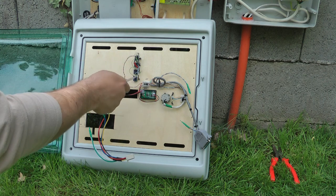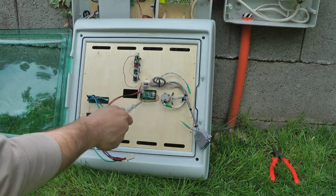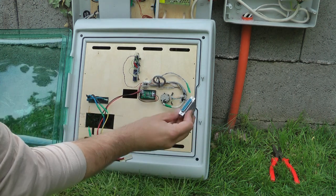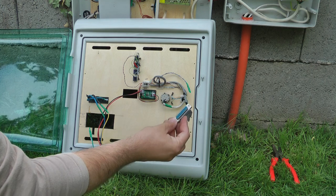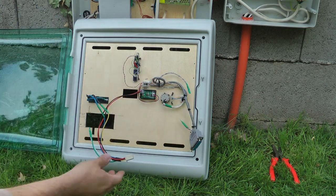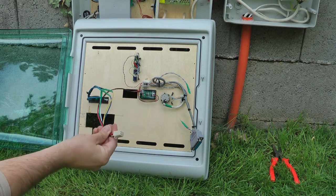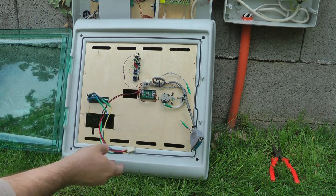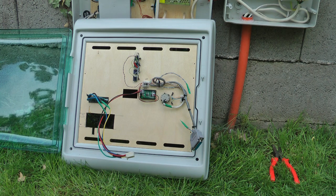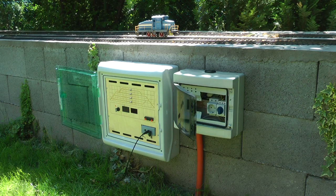The back of the control panel - that big thing is my external power supply, these are the switches for the individual tracks, that's the amp meter, the rotary switch, and you can see the male plug of the 25-pin adapter, with the other side on the main board. There's also the other cable plug, so by unplugging these two I can take the whole panel off - it should be fairly easy to change things and service it later on.